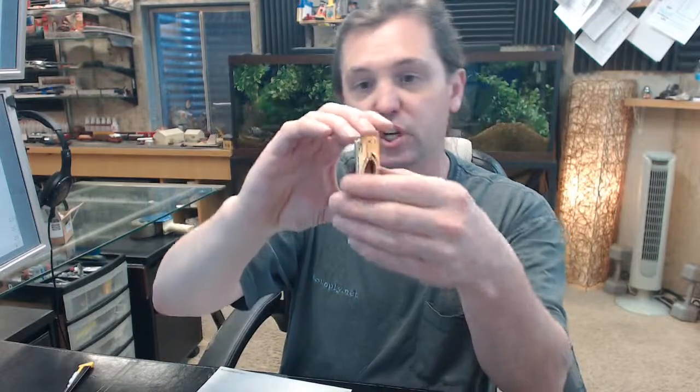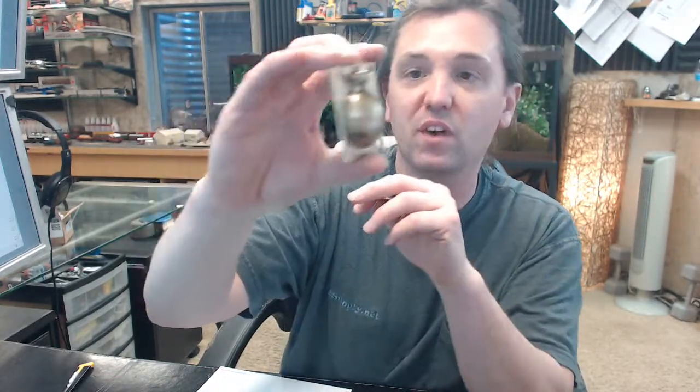Now machining for this, I've machined for these plenty of times, and I've done it where I was being very lazy and just used a chisel and didn't really love the end result. There were times when I was doing production and wanted to do the best job possible, where I would employ a Forstner bit for this diameter, down to that depth. I would finish this portion out by hand, and then I would use a router and a template for the faceplate. So a little bit of handwork.